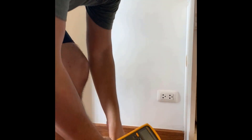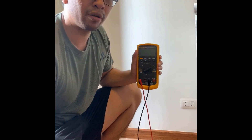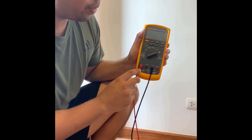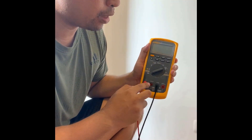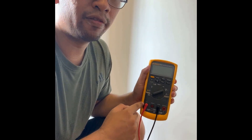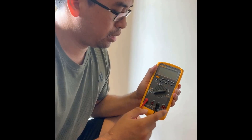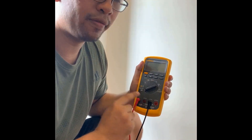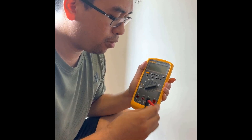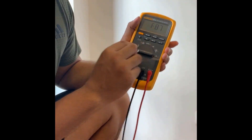If you don't have the tools I have, you may use a standard multimeter, but you have to be very careful. Notice that the red probe must be plugged into the voltage socket, not the current socket — you cannot measure voltage with the red probe plugged into current, as this will blow up the fuse in your multimeter and cause the MCB (Miniature Circuit Breaker) to trip. Whenever you are measuring voltage, switch the red probe to the voltage socket and turn your knob to AC.